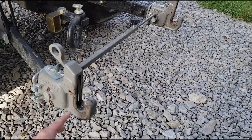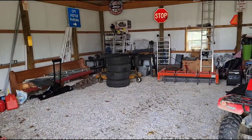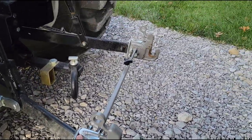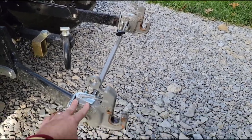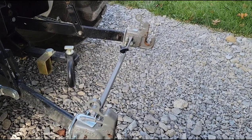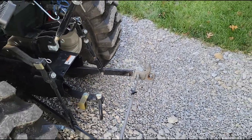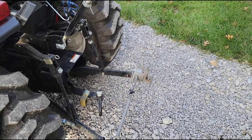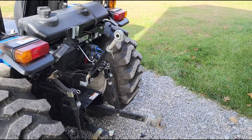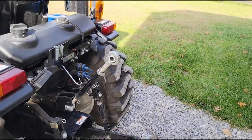You're not really supposed to use these with a mower, but I even use them with the mower — it's over there in the junk pile behind the tires. The PTO shafts seem to be long enough to work out okay, so mower, box blade, land plane, aerator — whatever — this system will work just fine. You still have to do the top link manually, but that's not a problem because the top link is easy and adjustable, so it takes a matter of seconds to hook up anyway.